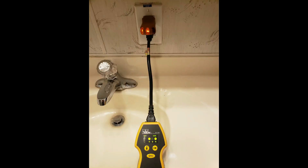Moving on to the bathroom, we find something even more dangerous than an ungrounded or reverse polarity receptacle. What we have here is a false ground. You can see with the three-light tester on the top — the kind most home inspectors and some occupancy inspectors use to check circuits — it shows that it's properly grounded.